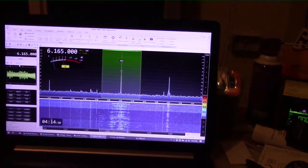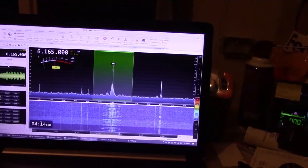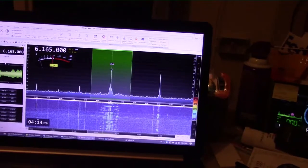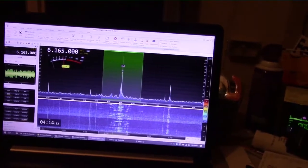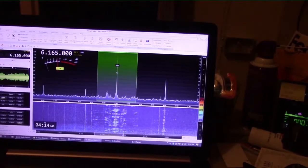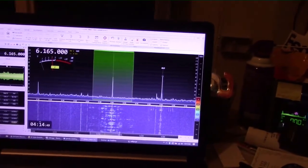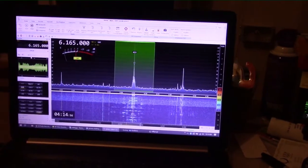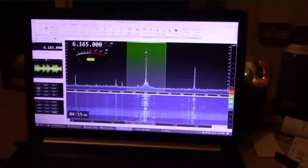So clearly down in VLF, very, very low frequencies, the passive antenna, the YouLoop that I modified by increasing its circumference, has clear major advantages over the small active antenna. But for general shortwave listening, for frequencies above, say, 40 meters, 49 meters, say here at 6 meg to 7 meg, I'd say that's about the break-even point. The MLA plus antenna seems to do a much better job. So anyway, hope this was of value.